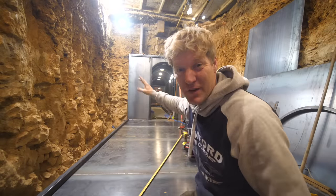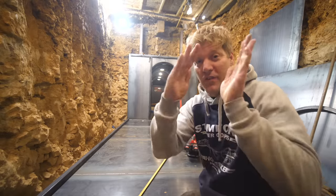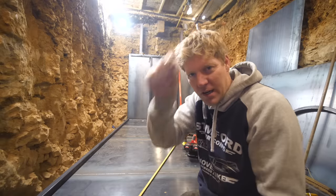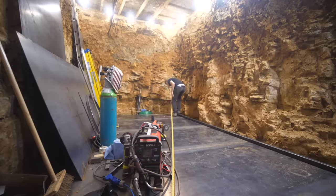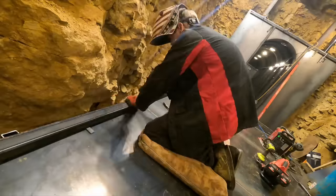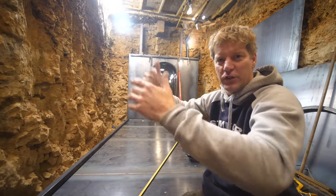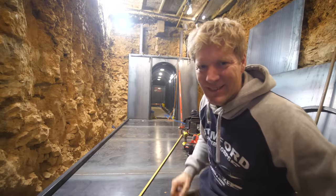It needs to be dead 90 degrees to that one, or all our measurements are a waste of time. The easiest way to find out if something's square is to measure the diagonal - I've been on the computer, drawn it, and I can see what this measurement should be. I've laid my tape measure across and put a bit of 50mm box section along the wall in the right place. Now I'm going to get a load of little tabs, weld them to the floor so when we get the sheets we can push them up against the tabs, weld them all together, put all the uprights up - and we've got a wall at 90 degrees.